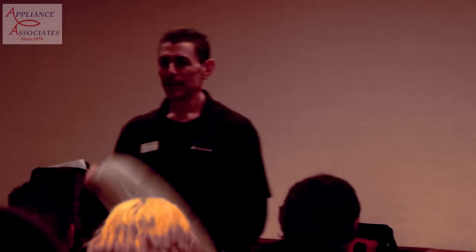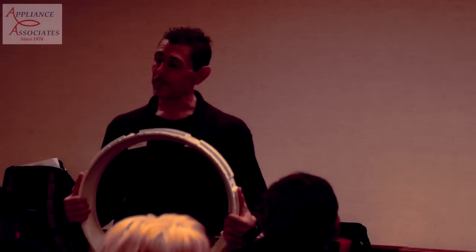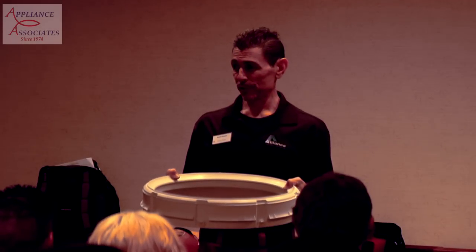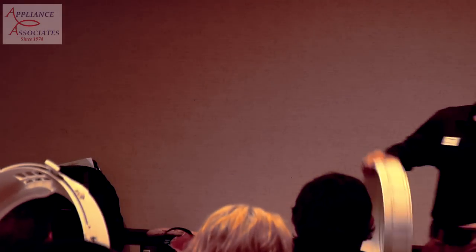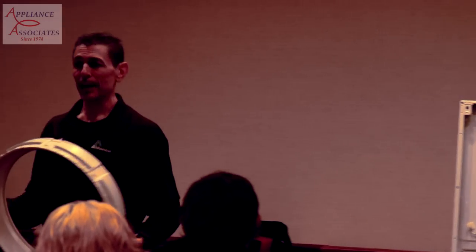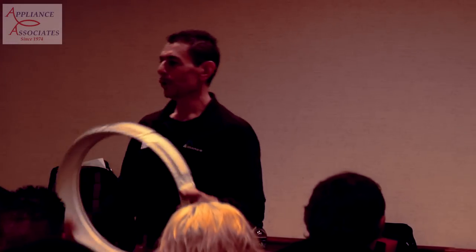Okay. The other thing is, if you're trying to diagnose, is this bad? The easiest way is to spin the machine with nothing in it. If you're getting a lot of vibration, then this balance ring is probably not doing its job, probably doesn't have enough fluid, you've got it leaked out. It does happen. The symptom is excessive shaking empty. With a load, it even gets worse. So the way that this works is if you have a load that is offside here, this fluid actually congregates to this side, the opposing side of the off-balance load. It's pretty neat how they do it. They don't tell me exactly, proprietary, but it doesn't have oil in it. It's just a salt type of solution.